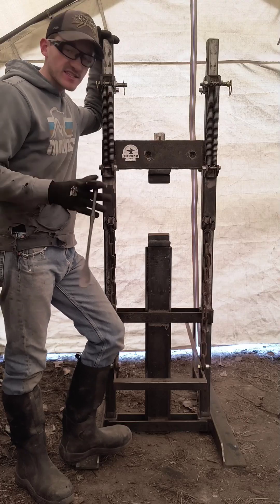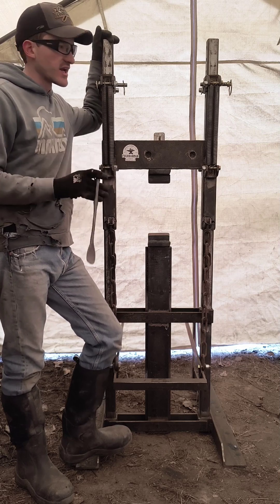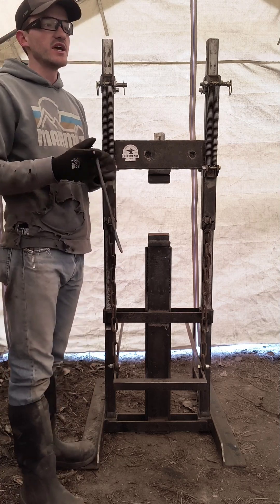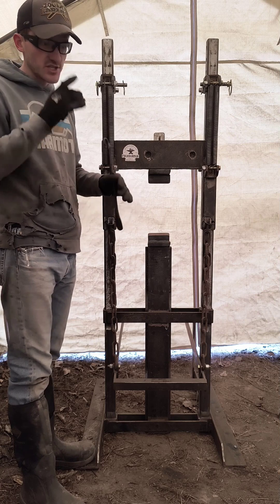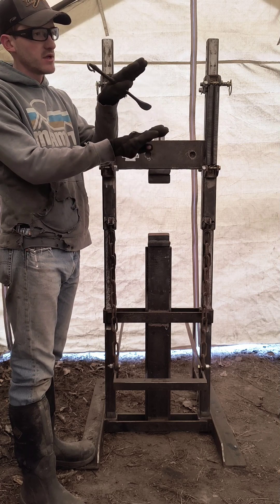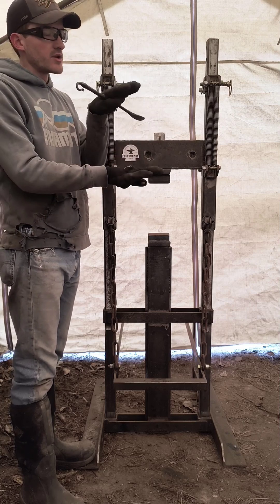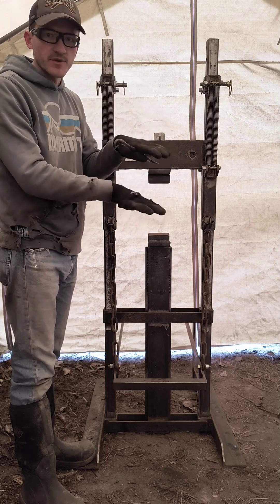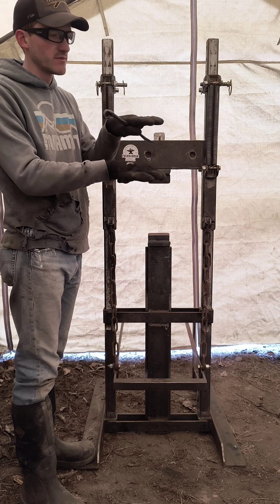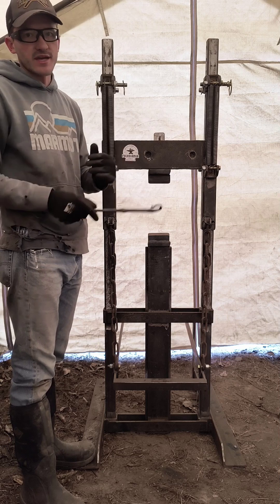And while that works, and it's a fascinating concept, there was one major flaw — adjustability. It could be adjusted, and the two main adjustments it had were being able to lift the ram up higher or drop it down lower. When you did that, the treadle kind of went up and down with it. So you raise the head, and the treadle would move in pretty much a one-to-one ratio in its distance.